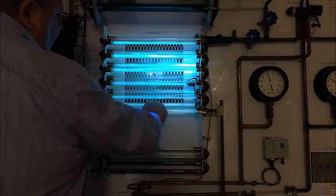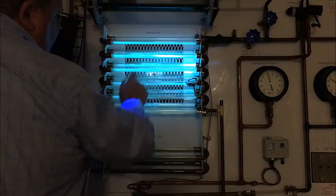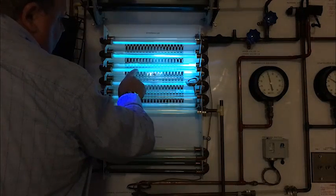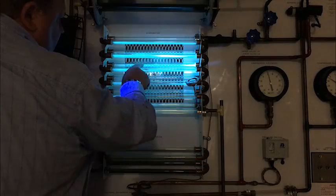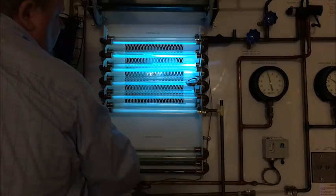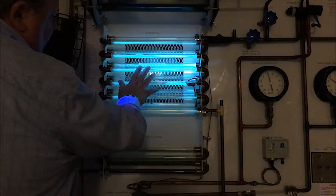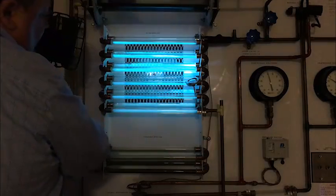What we're doing here is taking a rare look inside the evaporator of an air conditioning system. You can see as we come through the refrigerant system here, we start with liquid refrigerant in the evaporator. We're absorbing heat from the space around it and you can actually see the refrigerant starts to boil and change state from a liquid to a vapor. As it's doing that, it's absorbing the heat from the home. What I want to talk to you about is this boiling process of the refrigerant.